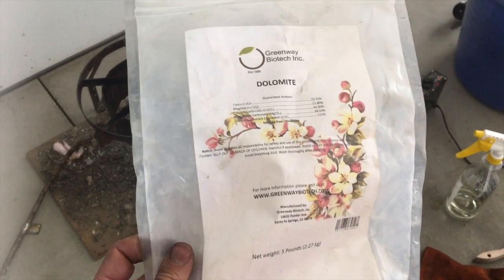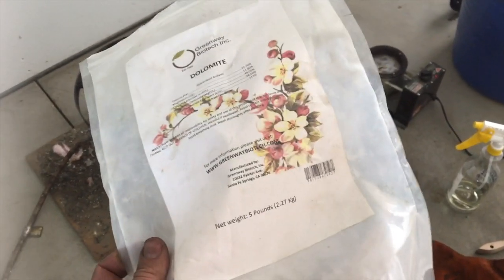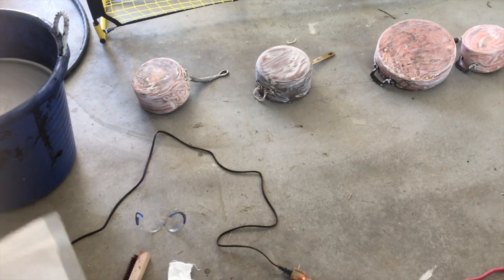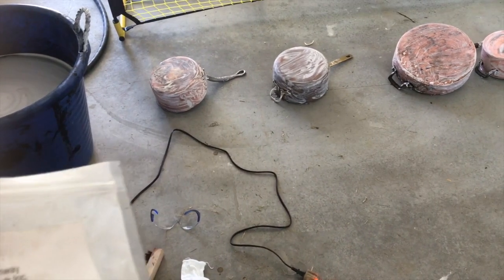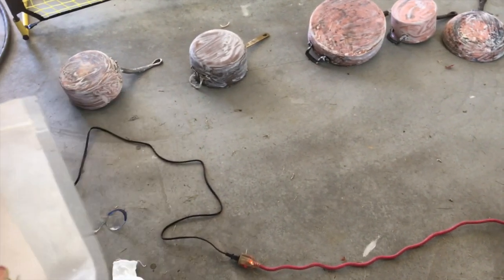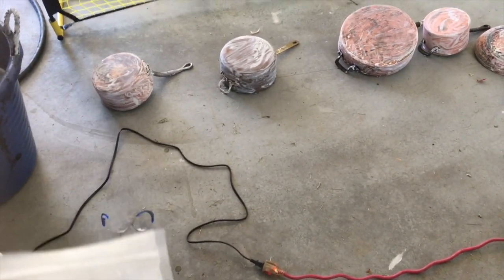So we're going to assume you have a clean pot. These are the tools I use for tinning. First and foremost: lime — like garden lime in powder form — that you will mix with water, which will then be put on the outside of the copper pots. This will diminish the amount of tin dripping on the sides, keep your copper from oxidizing over the fire, and make your polishing a lot nicer and easier.